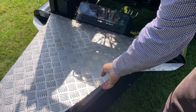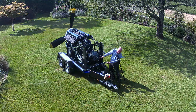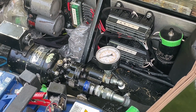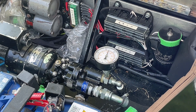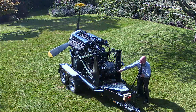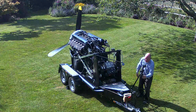I'm going to demonstrate the feathering. This is the button I use to operate the feathering. If you watch this pressure gauge — this is the feathering pump — you'll see it jumps up to about 500 psi. And looking at the propeller, you can hopefully see it slowly feathering — and that's it, it's fully feathered now.